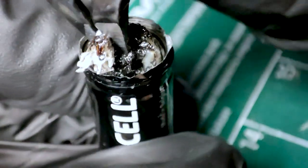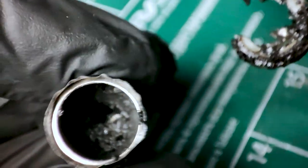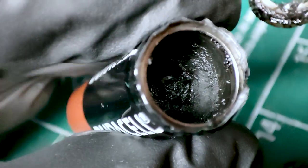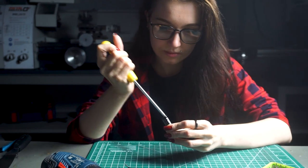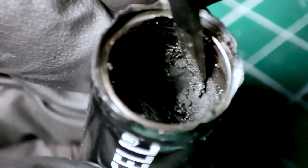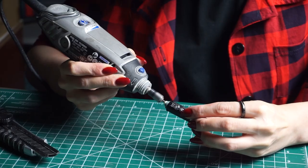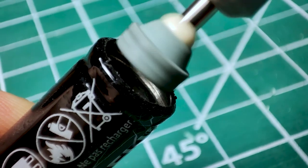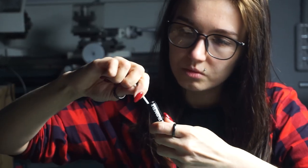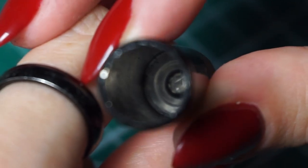Through the enlarged hole, it's now possible to remove the plastic plug and get access inside, from where we first need to get the remains of the anode. It's a zinc powder wrapped in a film. A black dense substance remains on the walls of the battery — this is manganese oxide with some kind of binding component. It also needs to be removed. After, with a file, I increase the inlet so that our future stuffing rolls through there. Having cleaned everything inside, we have a metal sleeve. Now we can start making the filling.